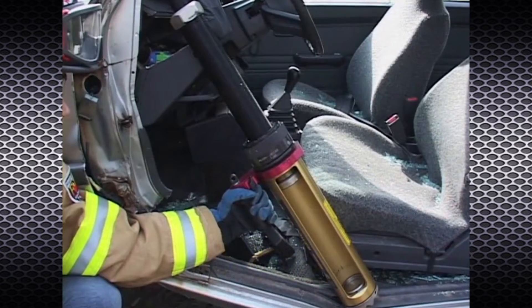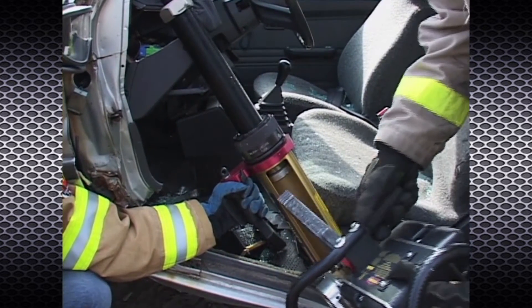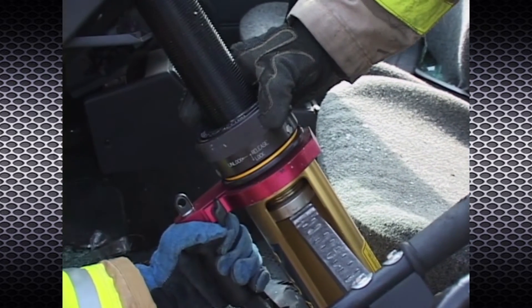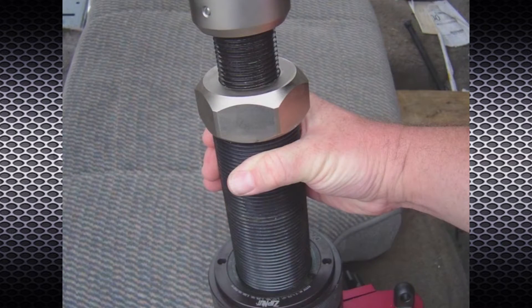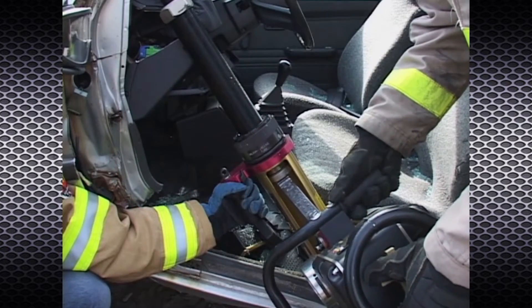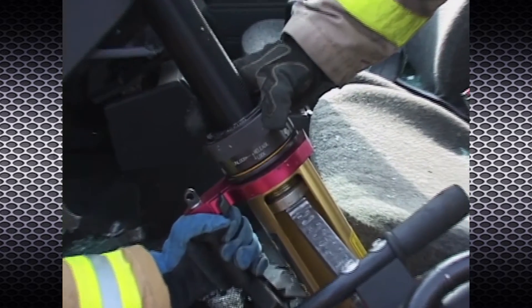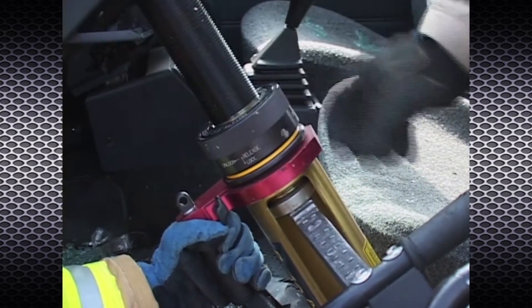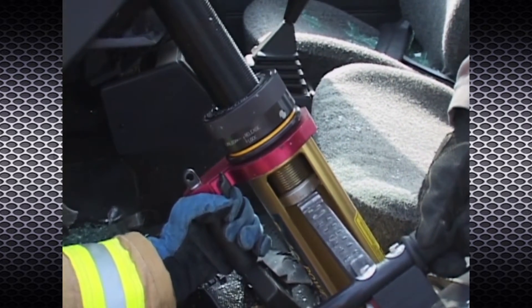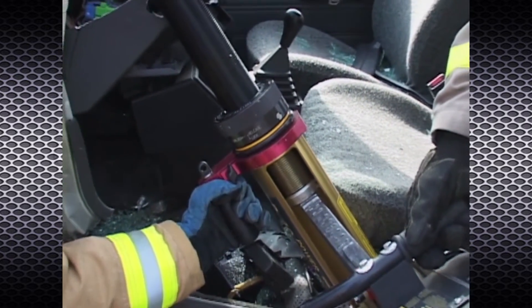To move the sleeve to the release or unlock position, use a spreader tool to slightly extend the primary extender and support the load. Never grasp the primary extender between the extender nut and Zipnut when retracting. The unlock position is achieved by moving the Zipnut sleeve upward and left. The sleeve will remain in this position, allowing the extender to extend or retract freely.